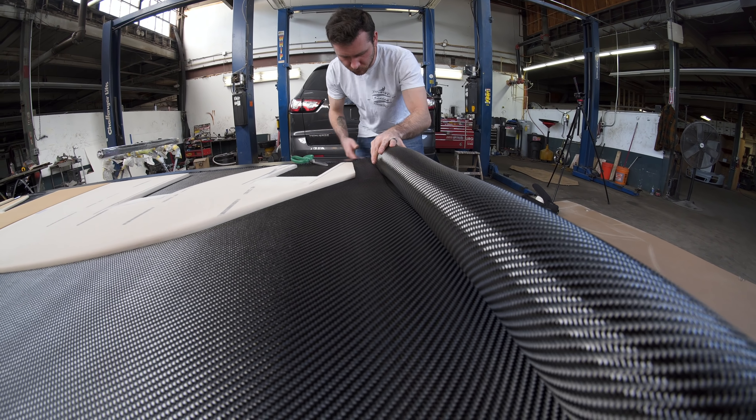I'm going to stay here and let it run — Xavier's running it. It's going to be like another 30 to 45 minutes until it's completely pulled everything. All I'm going to do is cap this off, wait until tomorrow, and then I'll record myself debagging the whole thing. We did find a small leak — I think I created it from using the spreader — but we had a small leak here. You'll see in the time lapse it'll be us poking at that corner. All in all, pretty good so far, just slow. You can see where the two pieces are separate — it ran through the small crack between them faster than the rest.